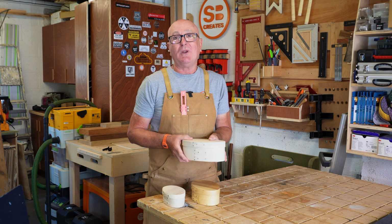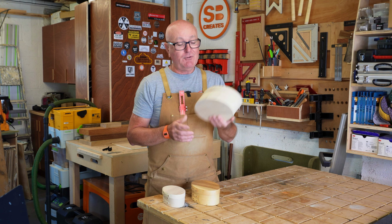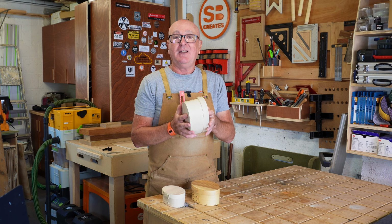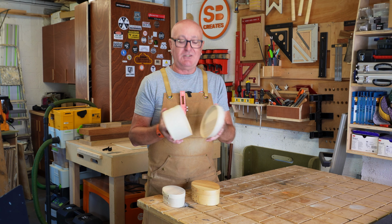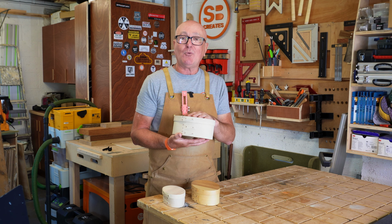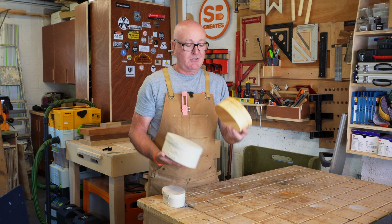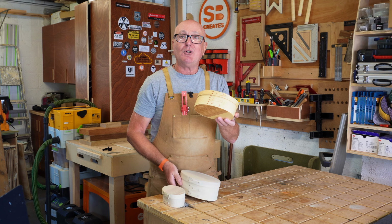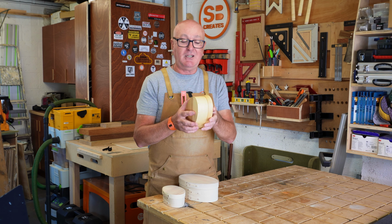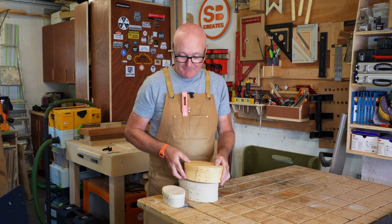The bending of the wood went fantastic. I'm over the moon with how the wood bent. And overall, they feel really good. The lids fit nice. I finished them with Rubio Monocoat, cotton white, and I think that looks really good. That's a number four box. The number three I did in Rubio Pure, and again, that one came out really good. So I'm really pleased with that.